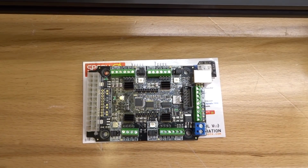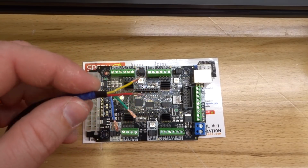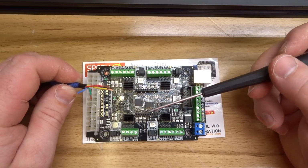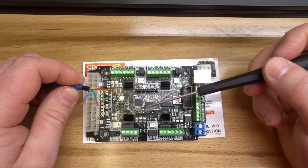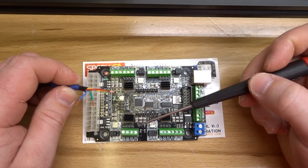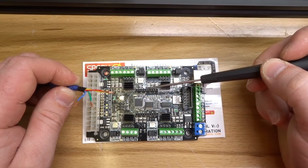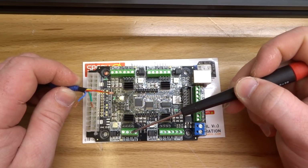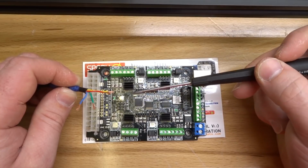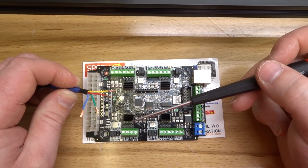So let's go ahead and locate that one. Okay, so once you've located your A axis motor, this is going to be the clone to the Y axis. Since this is a Cartesian style machine and it's running off of a gantry, both motors are moving in the same direction. So this works out perfect with this controller board because it's hardwired directly to include that function. So the A axis is always going to follow which direction the Y is. So the only difference is the motor orientation.